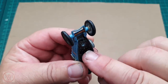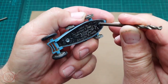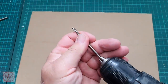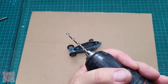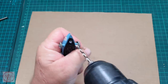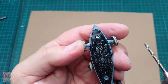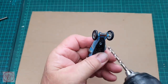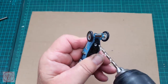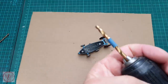To begin with I'm going to take that base off, just using a suitably sized drill to remove the end of these rivets or posts that hold the base in position. That took really half a second — just two turns of the drill removed the rim of the post. The front one however was a little bit more difficult, so I had to resort to using a slightly oversized shallow-cut drill to remove the edge of that rivet post so I could remove the base easily.